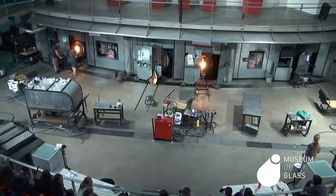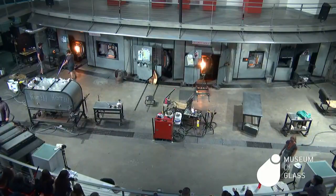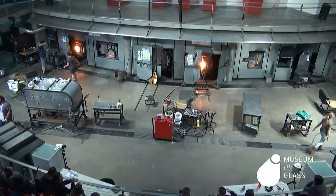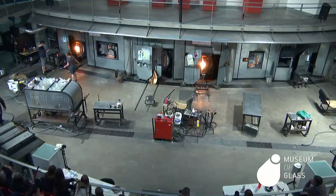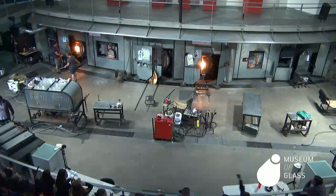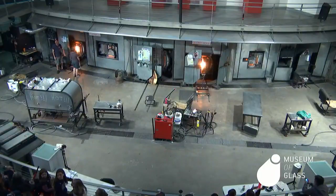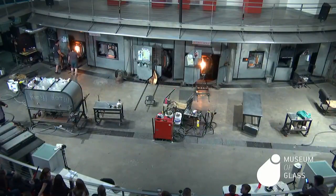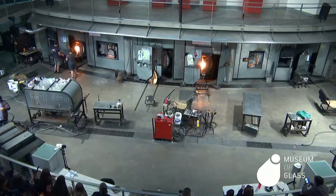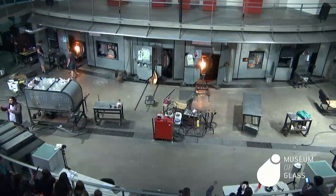So if the glass cracks, it cannot be reused, typically because it has color. No, this clear glass that we have here on the floor can't be recycled because it does contaminate our clear furnace. So the cubes, up on our top screen, actually not yet, we throw a handful of those small little cubes into our furnace and they melt down. So our furnace, oh yeah, when we dip, it's already molten.